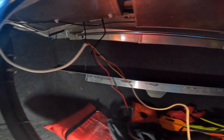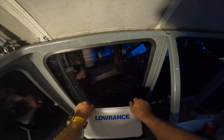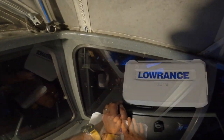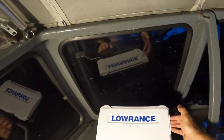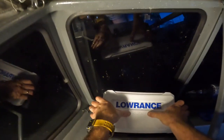Everything is taking a little longer but I want to do it right. The Cat5 from the radar is plugged in below — that goes to the FS9 head unit. This is the power for the FS9. Now going downstairs. A side note: taking the cover off the Lowrance FS9 is virtually impossible unless you know the trick — four fingers on each side, thumbs next to the Elite logo, press the thumbs, and it comes off.